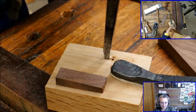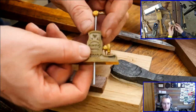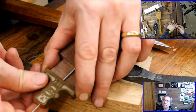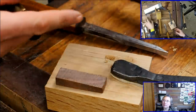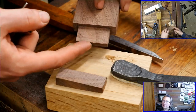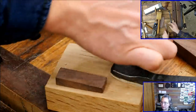To find out the depth, I have this beautiful depth gauge I got at the Pacific Northwest Tool Collectors Meet. It's basically a rod sticking through a block — you can make one with a small block of wood and a friction-fit rod. I set it on here to know this is the depth of the tenon. Because we're doing a wedge tenon, it's fairly important that the bottom of the mortise be precisely the same depth as the tenon. For a regular tenon I'd take the mortise a good bit deeper, but for a wedge tenon the bottom needs to be just touching or ever so slightly shy of touching.